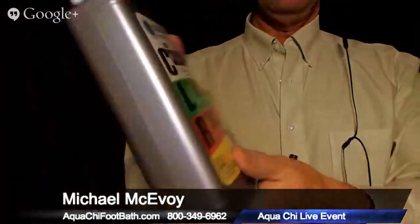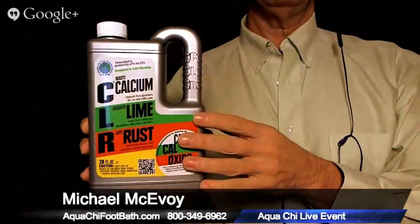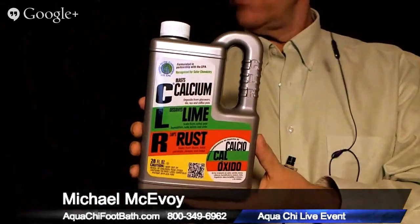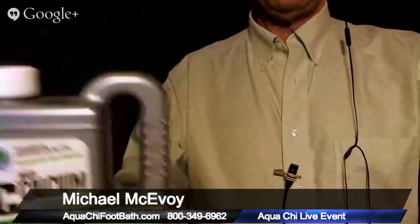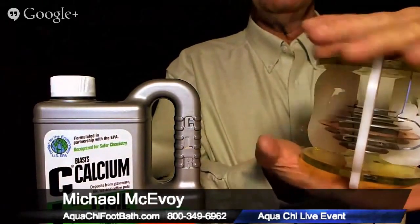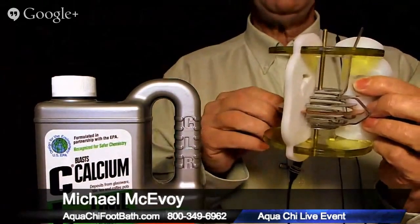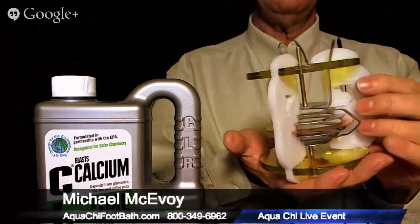Okay, so in case you have not used this, you should be using this to clean your module. This is available in any supermarket, Walmart, Target, you can get this. You'll need a couple of bottles of these, and use it full strength. Put it in a Tupperware container that would be big enough to submerge your module from tip top to bottom. You don't want to have anything sticking out of the water. So this module will be fully submersed in CLR. A couple of bottles should be enough for a Tupperware container a little bigger than this module. And you'll have leftover, of course, so you can replenish it.